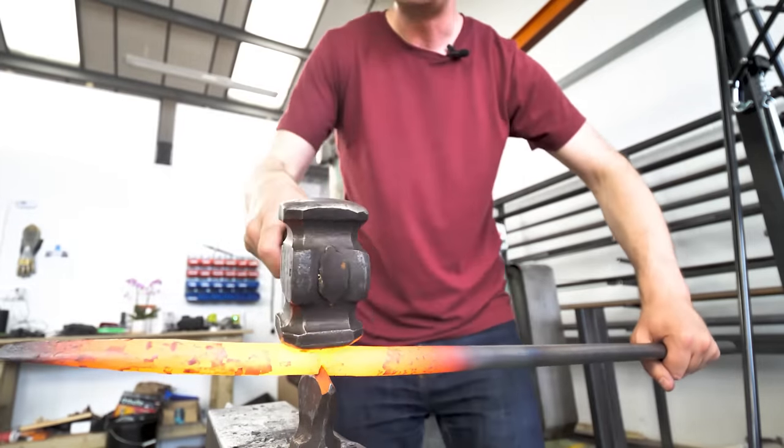So as you come up to this shoulder, you've got to be a little careful about the edge of your hammer. But again, hammer all the way around. As you come to the bottom, your grip's going to have to change, like this. And you're going to get your arm a little bit close. If you want to get it further away, just step like this. And you then come up, now hitting with your hammer in this direction. So you notice I started hitting like this. As I come down and I change my position, I hit like this. That's not meant to be easy to understand. It's not. There's a hell of a lot of moving parts.